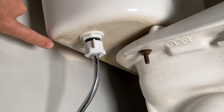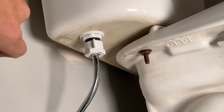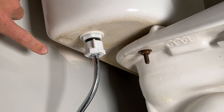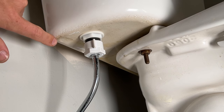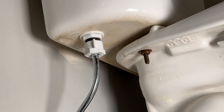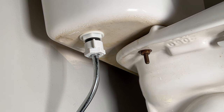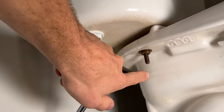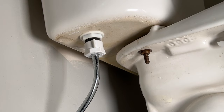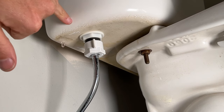Here's a look at my issue — I have water that is traveling along the tank and then dripping from this corner. Just because you see the drip here, that does not mean that's the source. This is just the lowest point for which the water travels before it drips off onto your floor. You can also see a little bit of water here on this lip from the bowl, so most likely my leak is coming from common sources: the attachment bolts and the associated gaskets, or the larger gasket that goes between the actual tank and the bowl.